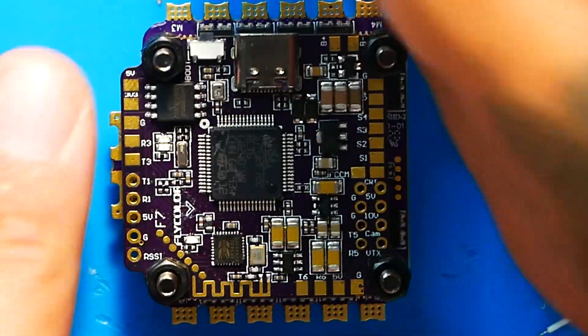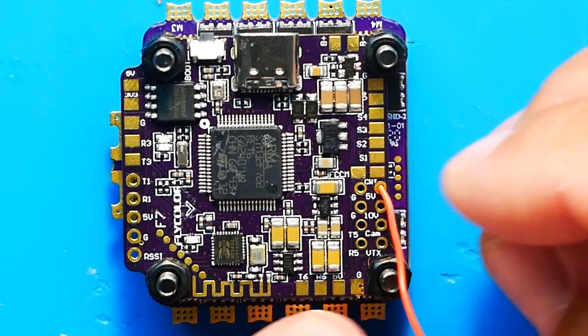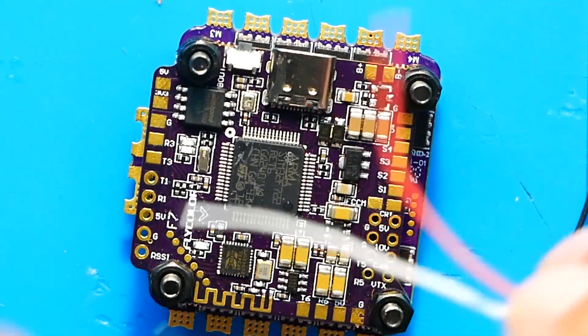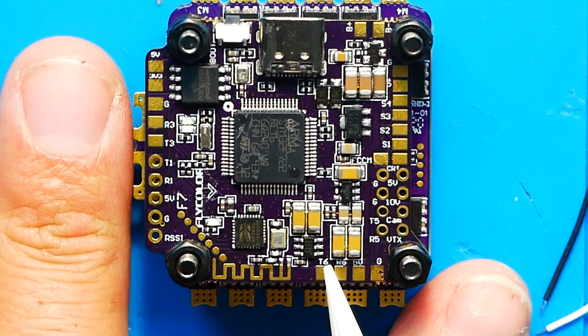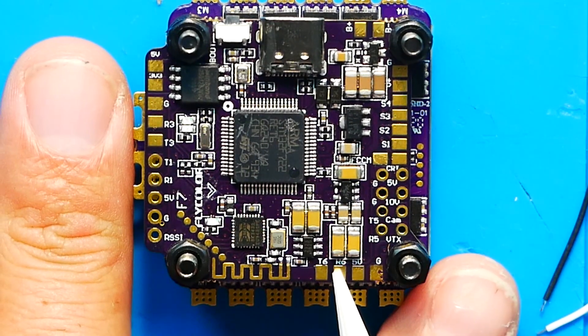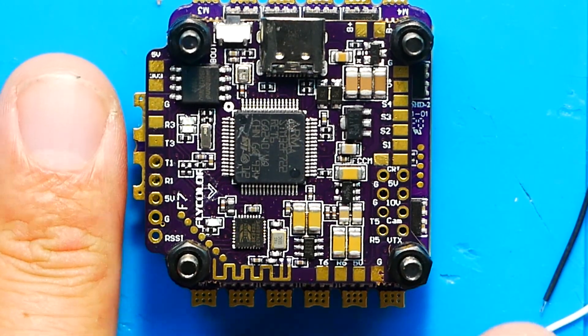They've laid it out properly so you're connecting your camera at the front of the board and installing it at the front of the drone — not wiring it at the front and connecting it at the back. These are through-hole pads, so you drop the wire into the hole, put a little bead of solder on it, and it will literally never come out — they're a bit stronger than a flat pad. Down here there's another UART with TX6 and RX6, plus another 5 volt and ground. So already we've got two UARTs — UART 5 and 6.